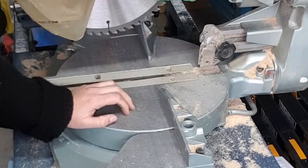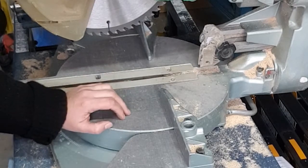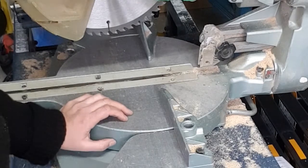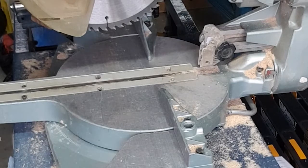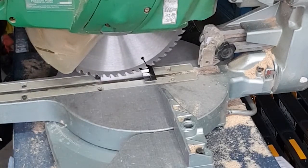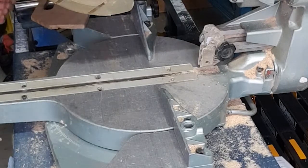This is quite an old drop saw. It's been used for construction work, not fine woodworking. And it's been thrashed, basically. It's cut concrete covered wood. It's cut all sorts. And the guys don't tend to look after it as fine artist wood. So it's always good to check that your blade and your fence are straight. Just going to check this other side as well, because with the fences being separate. Yep, that's lovely, jovely.